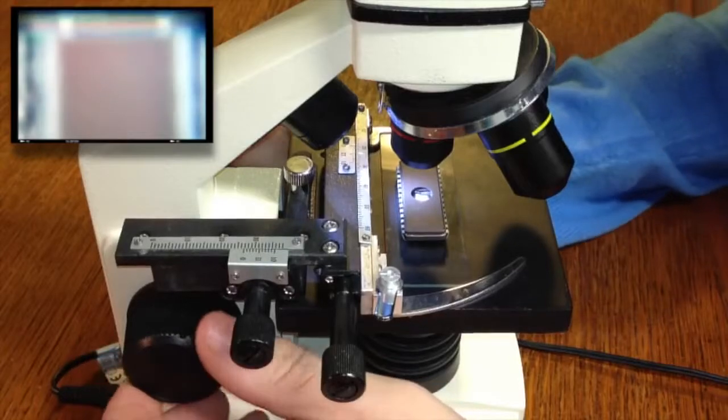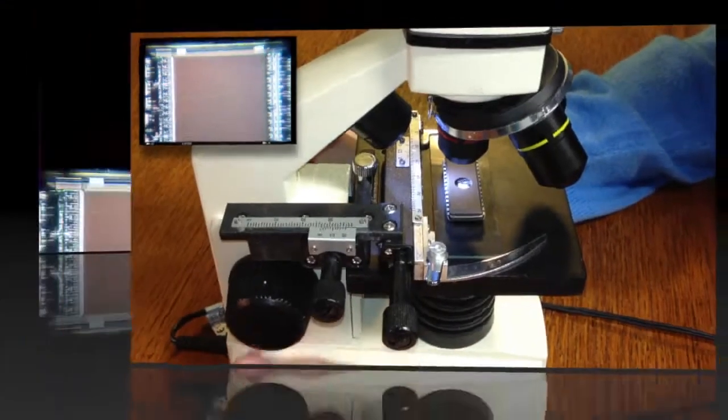At just 100 times magnification, there isn't all that much detail visible, but we can see the majority of the main parts. These two large, seemingly blank areas are called the memory blocks, and can contain billions of tiny transistors, which each store a bit of data. This particular chip is a 27C512 from ST Micro, which can store 512 kilobits of data, so will contain at least 512,000 of these transistors, each serving to store either a 1 or a 0 by switching on or off respectively.